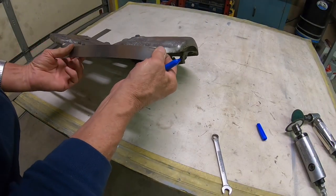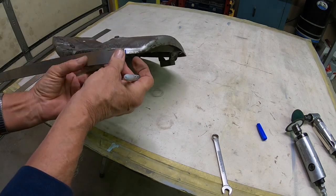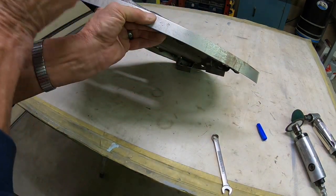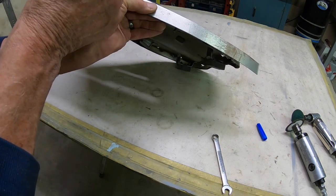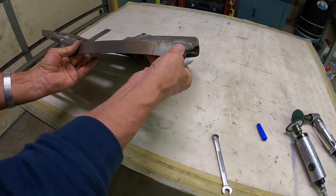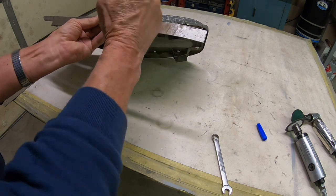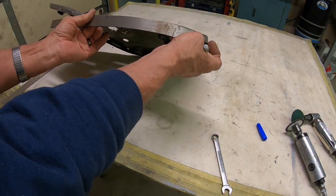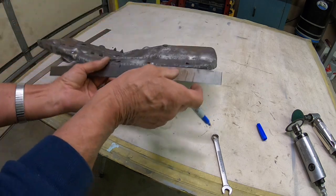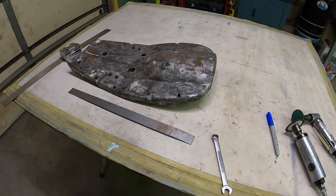All right, let's see here. I've got good material right here, so I'm going to start right there. That's where I'm going to start my cutout. And you can't go all the way around because the arch of the pan is not straight, so it's going to run down on you. That's another reason why you piecemeal this thing. So I'm going to go to about here, I think. Yeah, right about there, and then I'll be able to get back in, reposition this other piece and go this way. I may make it in two pieces. It might take three. So let's get ready to cut that out.